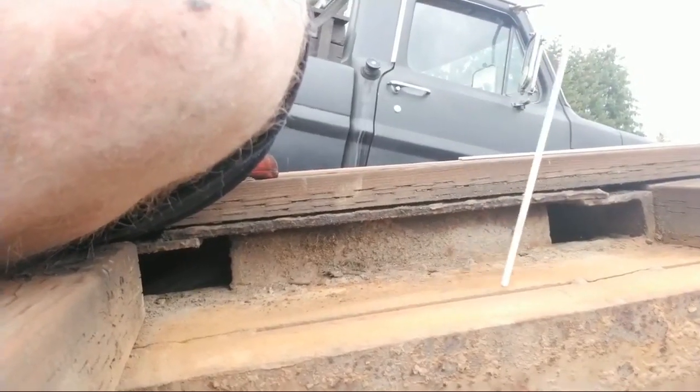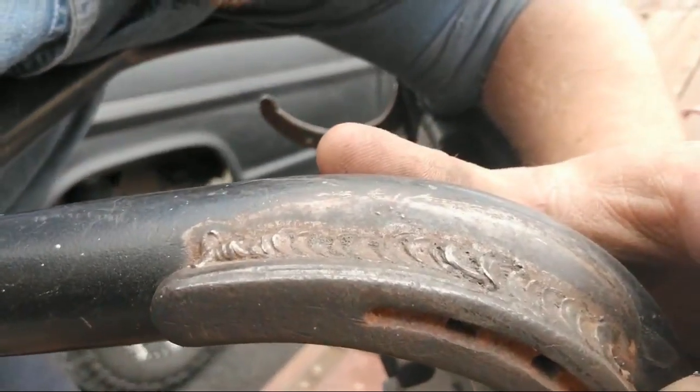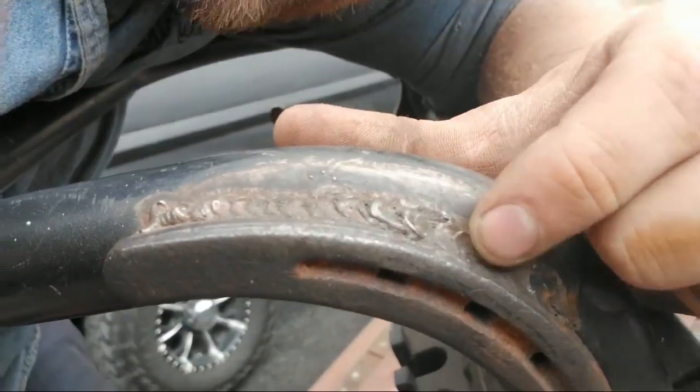And what you're gonna want to do is you're gonna want the welding rod at the end of the welding puddle. You'll see the little puddle. The puddle's probably about that big. You want the rod to come and just barely touch the end of it each time, so each time you're getting that much further along, and that will cause the weld. Let me just show you an example, something I did a long time ago. Okay, see the little puddles? That's what will cause the puddles to lap over each other, kind of like a stack of dimes.